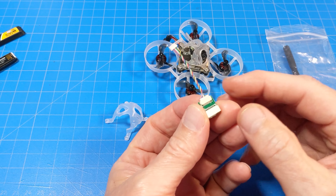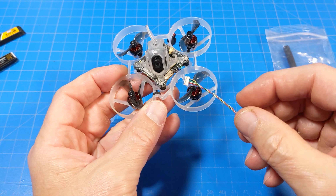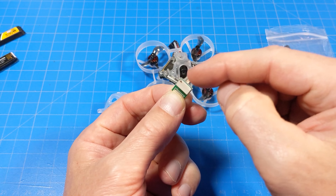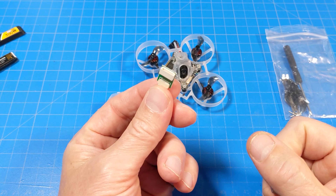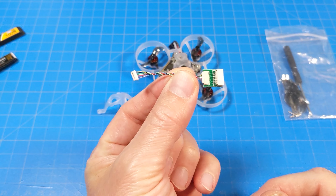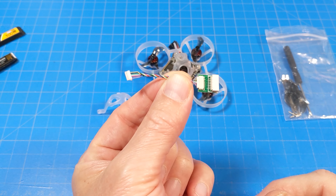This is what we're going to use to update the firmware on the VTX. In my case I didn't need to because my VRX was already running the same version. But traditionally you'd plug it in right here, then take the cable that comes with your VRX, plug that in here, and attach that to your VRX to do the updating. You can find full instructions on HD Zero's website as well as online tutorials — make sure you don't lose this piece because I have yet to find one on sale by itself.